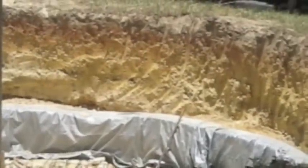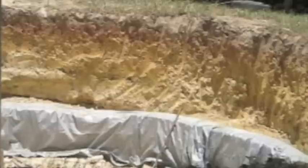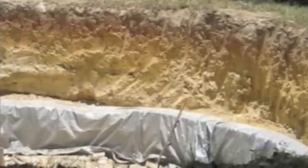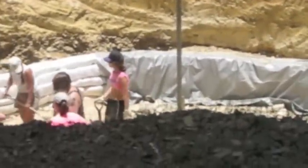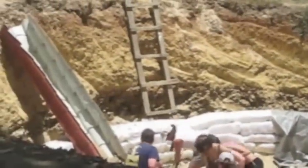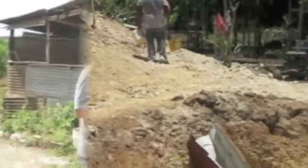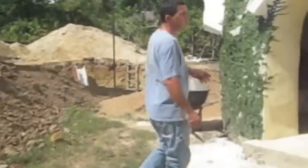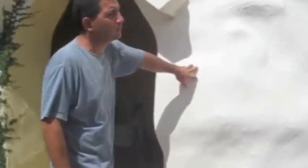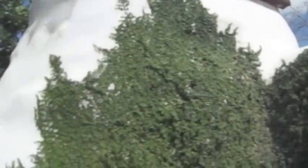You can see the different layers that we're using. The back layer is the best, which is our rocky clay material. Then the middle layer is more clay, which we're going to use for the walls above ground. And then we have a final layer — it's just topsoil organic layer — which is not going to be used at all for the bags. It'll be used around the building to slope water away. The purpose of the hole is to create a multi-storey cylindrical tower that's going to be a kind of root cellar with different insulated compartments inside.